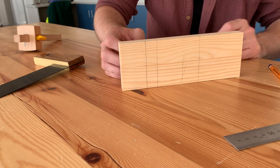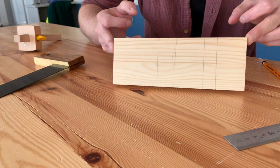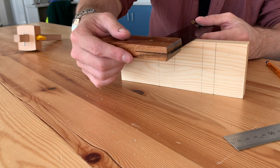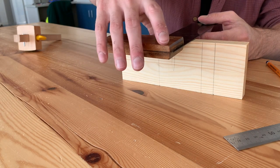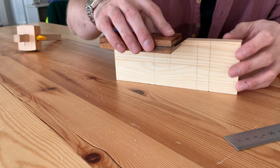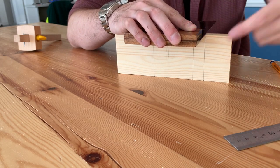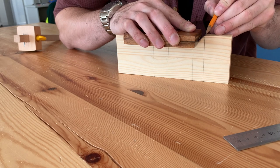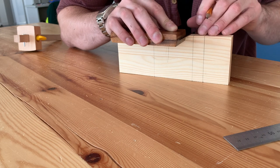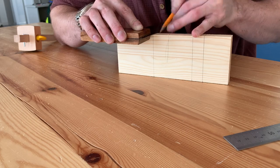You're going to be able to see this second part a lot better. I flip it up so the lines face away from me, take my trisquare and flip it over so it's facing towards me, put my thumb on the timber, and push it in from the back with three fingers. I slide it over in line with the line and mark all the way around — one, two — and there's the fourth line.